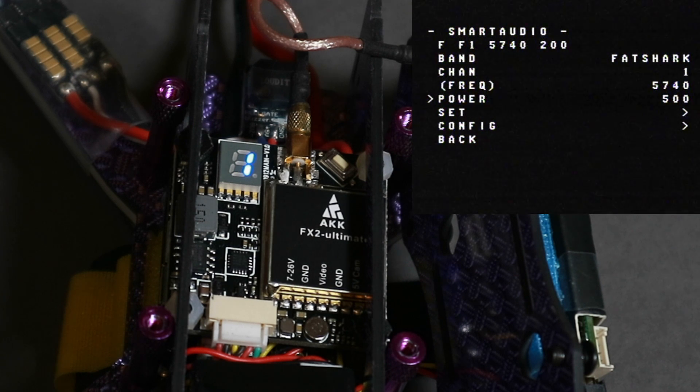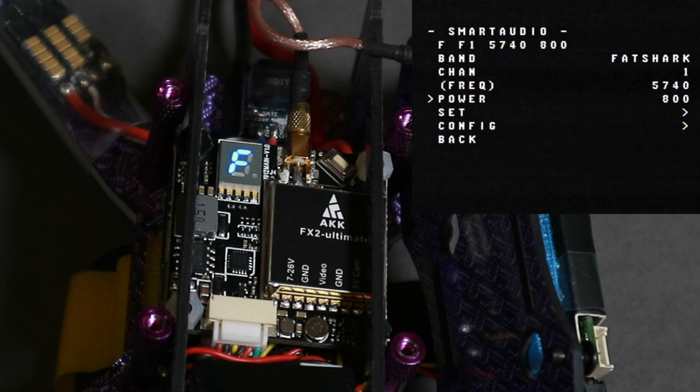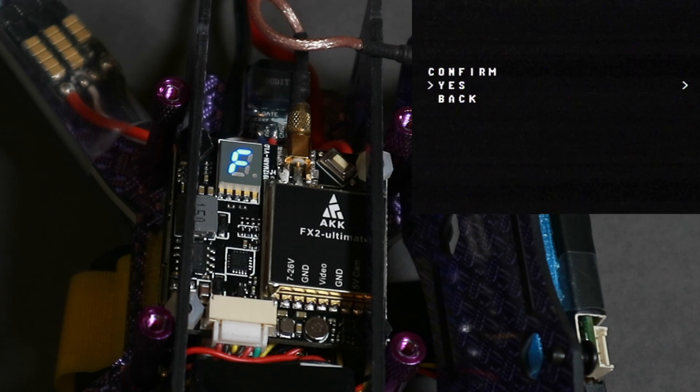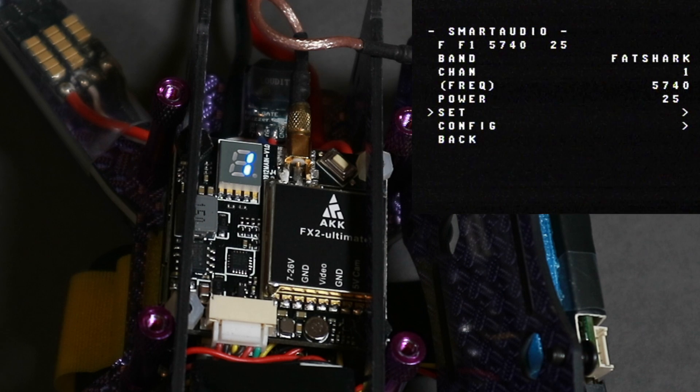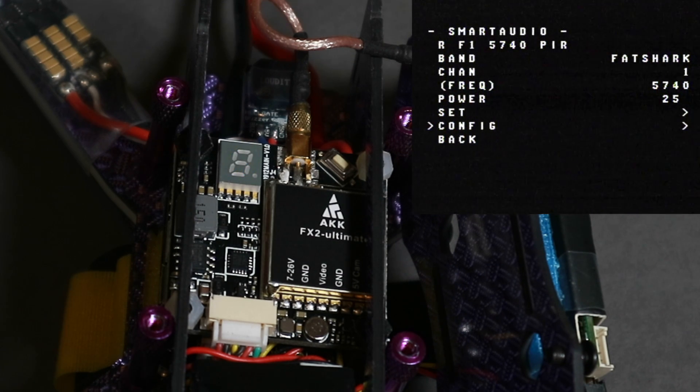So when we set it to 500 milliwatts on the OSD, it's actually setting to 600 milliwatts. And similarly, when we set it to 800 milliwatts, it will actually set to 1200 milliwatts. You can see the numbers 1, 2, 3, 4 on the VTX — that's the main thing to take away. What you see on screen doesn't necessarily match what's there. There's also pit mode available — you can put it into race mode and that will automatically put you in pit mode at around 0.1 milliwatts, shown as a flashing P, letting you set your power and channels before coming out of it.